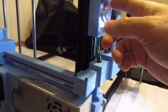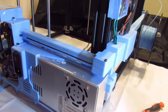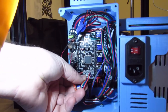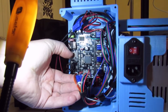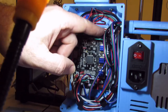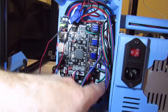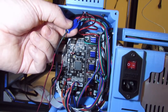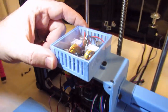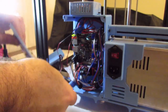This top cover makes it easier for running the wires to the main board. It also gave me an area to break out the two buck boards for the fans on the hot end — the part fan and the cooling fan. It has a simple cover that fits into the slot and bolts in place with a couple of M3 bolts. I had to cut the notch out to allow those wires to go up through since they were an afterthought. If you don't use the buck boards or if they're located in your main box, you won't need that cut out. The BL touch wires are on quick disconnects that change it from the BL touch style to the JST style. Then you have the end stop wires, fan wires, and all the various motor wires coming through that same channel. The fans for the cover have longer extensions going to quick disconnects, and I use some blue tape to keep those from popping off.